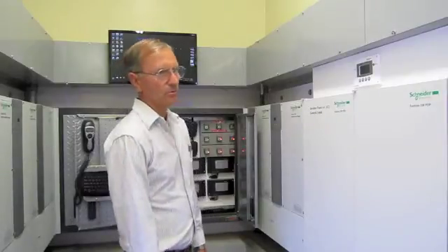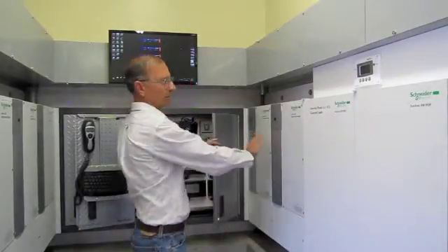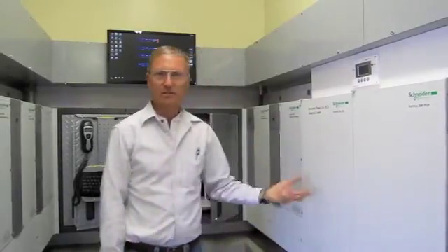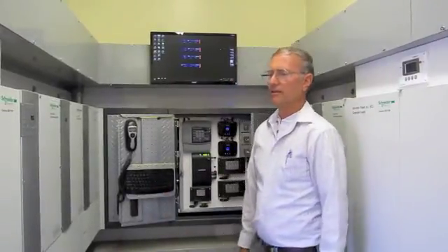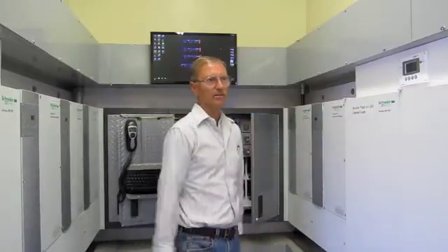In order to accommodate the various load centers in the house, we put one bank here. This particular bank runs the outlets and heating systems in the house. The one on my right is strictly for the mechanical room — that's running water pumps, fire suppression pumps, and what you see in this room. And then there's another bank on the other side of this wall that is strictly for lighting. The house has a lot of backlit marble floors that take a fair amount of energy, so we dedicated one bank just to that.